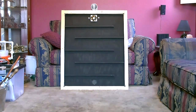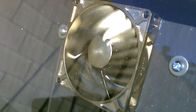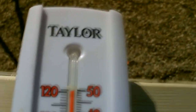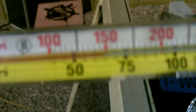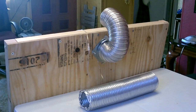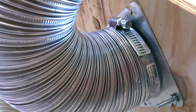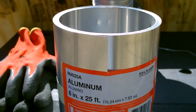And finally the channel solar air heater — no metal at all in it. It got to 120 super fast, and a more typical reading was 150 degrees. If you really want to go all out, cut down some pieces and tack them into the channels — you might get 10 or 20 degrees hotter, maybe more.